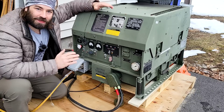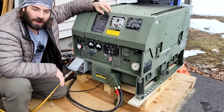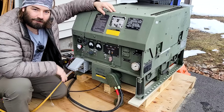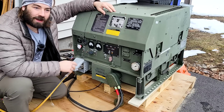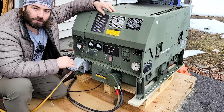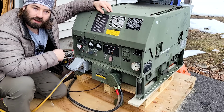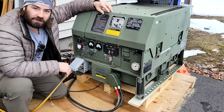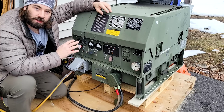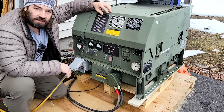Awesome. Curt, thank you so much for designing a governor controller that works this well. That just worked beautifully, and I didn't have to fiddle with anything. In a future video, I hope to set up an auxiliary fuel tank so that I can do a proper fuel economy test and measure the kilowatt hours that we can put into the battery bank per gallon of diesel that we consume. Right now, I can't do that easily because with diesels, we have a supply and a return line, and I can't run the diesel empty.